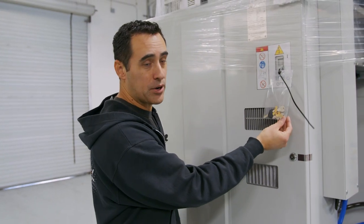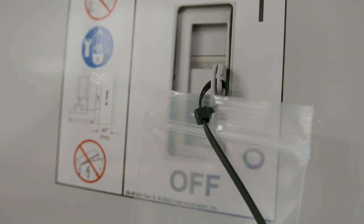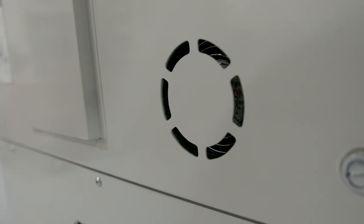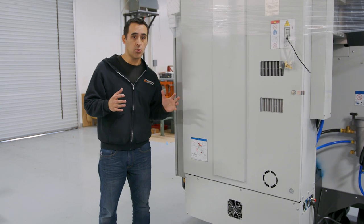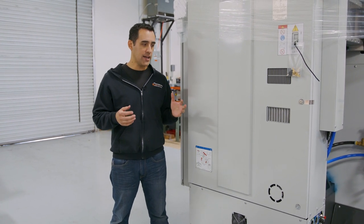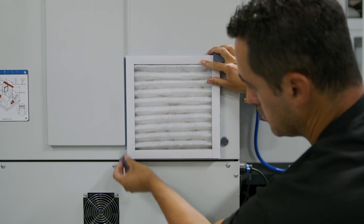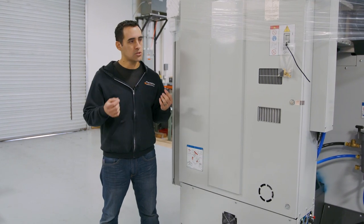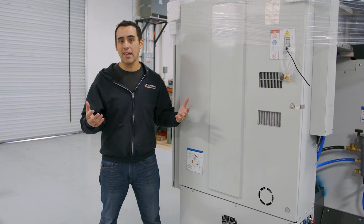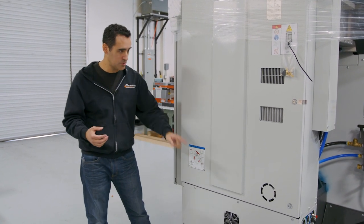You definitely want to make sure the keys are present. I've never had a machine with lost keys, but they're held on by a plastic bag and could be lost in transit — that looks good. The control cabinet is something that's changed often over the years. There's a new vent with a fan behind it. One thing we do around the shop is buy 12-inch square furnace filters — we have little magnetic clip-on things that I 3D printed — just to add another layer of protection and filtration. These filters are dirt cheap on Amazon and we throw them on as many places around machines as we can. It really helps and makes maintenance so much easier.